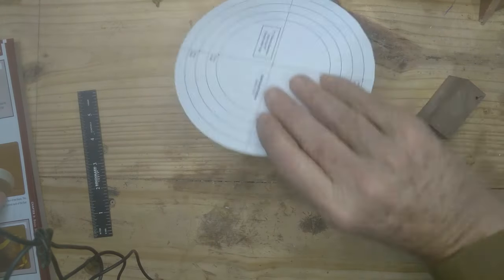That's mineral spirits. I'm just trying to see if there's any glue showing. I'll put this on and look for glue. If I see any more, I'll mark it with a pencil, go back and try to sand it, otherwise remove it. And then we'll see about putting a finish on it. Everything looks good so far. I believe we're good. I'll let that dry.